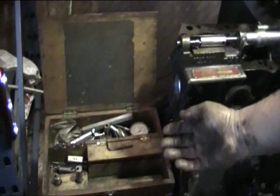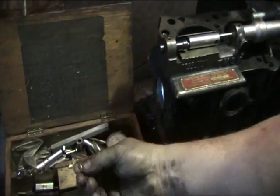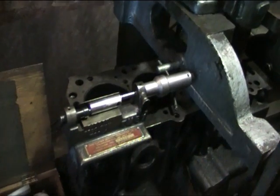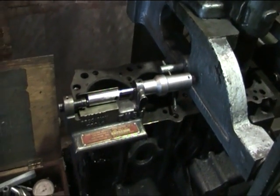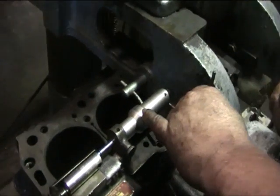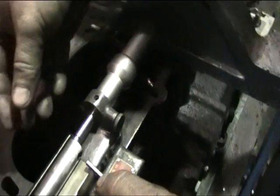This is some of the cutting equipment, the tooling for the machine. We have the carbide tips and we also have a diamond tip — polycrystalline — and it's in the micrometer right now. We're going to take another cut and let everybody see how we do this. We're going to remove five thousandths of an inch from the cylinder bore to true it all back up again.